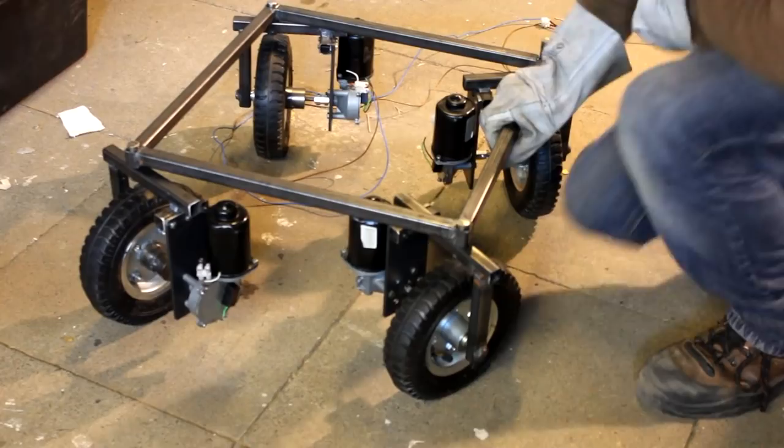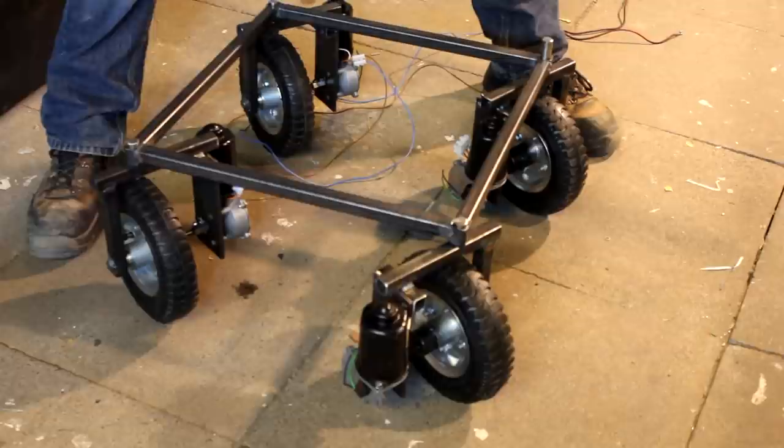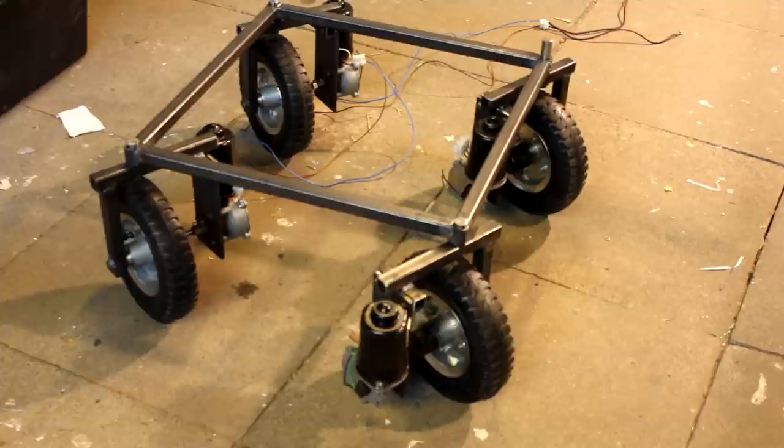But I actually don't really see a reason to employ this steering method here with the different angular velocities at all, at least not when you're driving indoors, and that is what this particular robot I think is supposed to do. So let me explain with these sketches here that I just slapped together in 5 minutes to explain what I want to do here. So the robot starts by just driving a straight line as far as that makes sense. It then stops, and then all four steering wheels are rearranged.